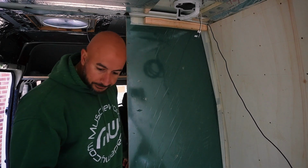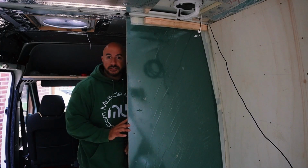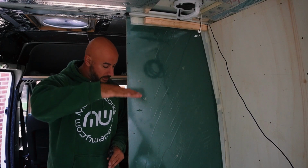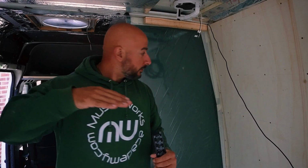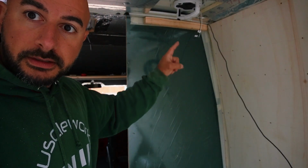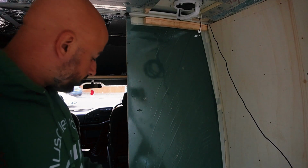And then we realised, where's my square? That this edge wasn't, I hope this is the right word, perpendicular to the floor. So it was tilted ever so slightly, which meant that there was a gap at the back. So I've had to sand about 2mm on an angle off the base of this piece, and now I've put it in. You can see the line is very, very close. I'll show you the bottom as well.